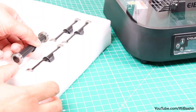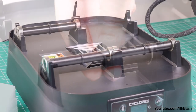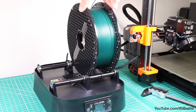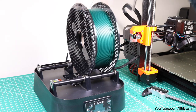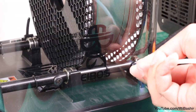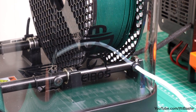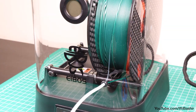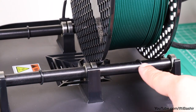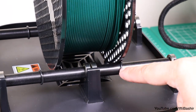Going back to the filament, the package includes spool holders with bearings that sit in the grooves on both sides of the tray, front and rear, providing the ability to place a plastic spool on top which spins freely. The package also includes some PTFE Teflon tubing that can be inserted into one of the various rubber-lined holes for the filament to make its way towards the 3D printer. So this isn't only a solution to dry filament before printing, but also a method of keeping that filament dry throughout a lengthy printing session. Rubber O-rings can be adjusted should you wish to use one larger spool in the centre, ensuring the spool doesn't move from side to side as it unwinds.